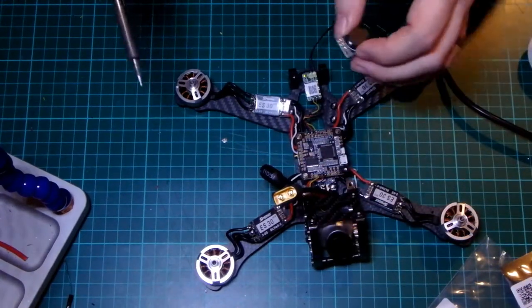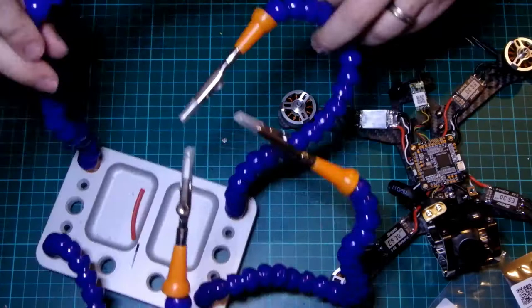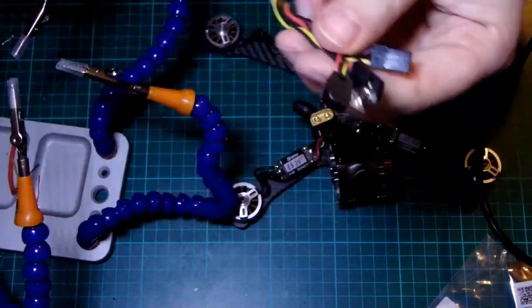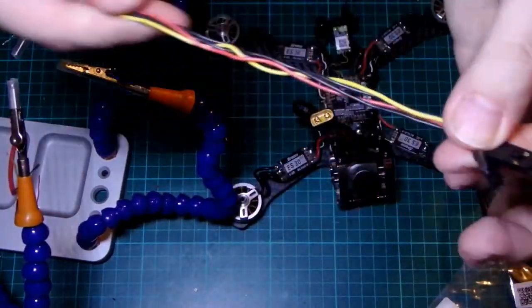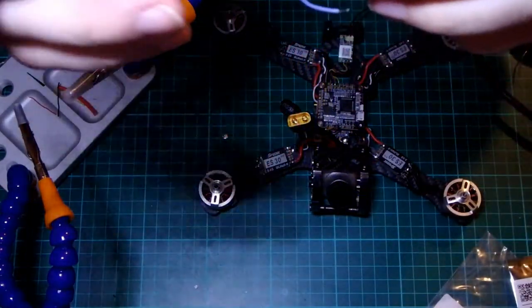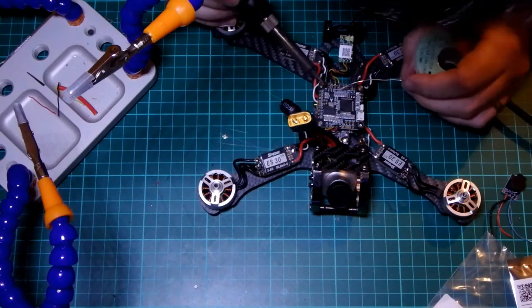It does make a packaging challenge but I think I'll put it on top of the flight controller. This just needs five volt and signal. I have a USB type cable that came with my Runcam 3 that I don't plan to use, so that is a good length of silicon cable. I'm going to strip this down and turn it into the cable for the buzzer. I've now soldered up those wires — I've used a blue wire so I know what the different signal wires are. Live is still live, ground is still ground, the signal wire goes on there. I'm going to tin up the plates on the flight controller and use the ground from over here.